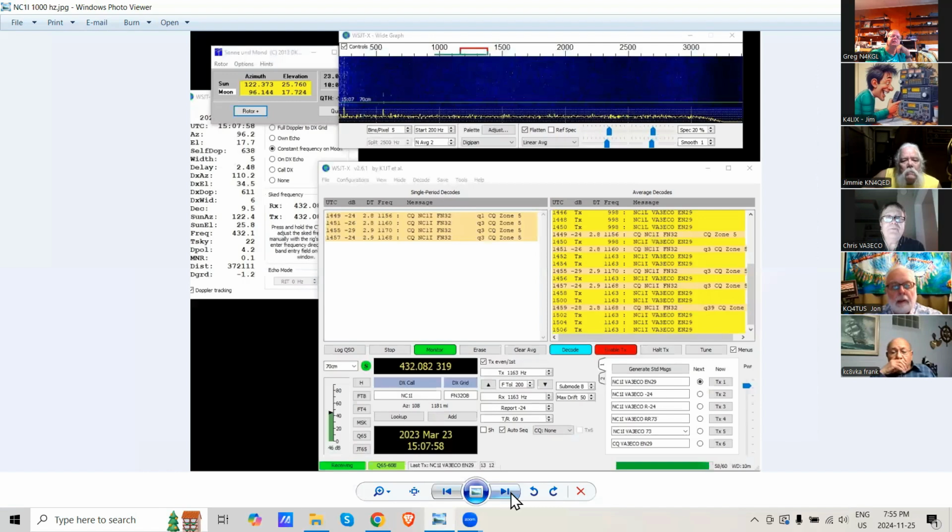Okay, attempt number 3. This is a guy named Frank down in, I think, South Carolina, or somewhere down near you guys. NC1I. He's got quite a farm. I'll show you in a minute. I heard him 4 times. I called him 8 or 10 times. He never heard me. So I'm lacking in power. By the time I get up to my antenna, maybe 35 watts. And I think that's my shortfall. I need more jam at my end. So a linear is a good thing to have. Although that guy with that little handheld had 60 and he made it. So there you go. Again, Q65-60B is the one we're using. We'll talk about that in a minute.